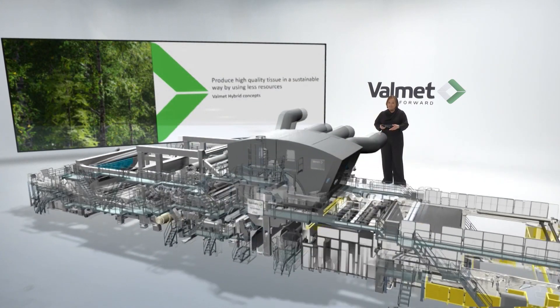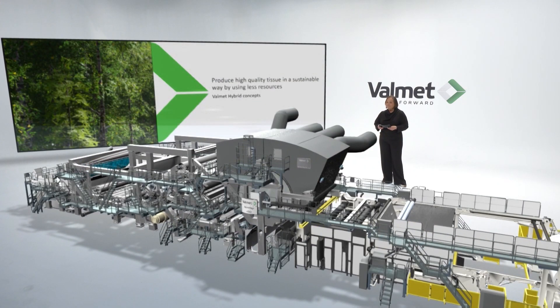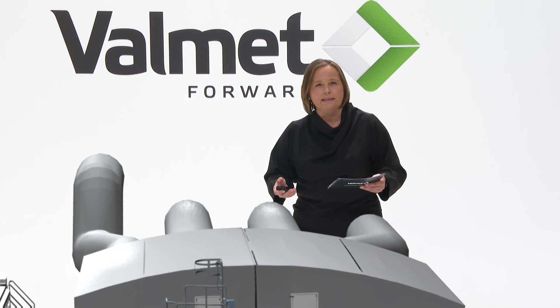And the ETAD you actually see being built right in front of me. These three technologies have been developed to meet the market needs and to tighten up the gap between the conventional DCT and the TAD concept. They are to be chosen when you want to prioritize product quality as well as energy savings, but also if you want the flexibility in your product portfolio to also be able to run DCT-like products and production rates.